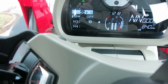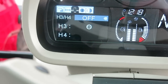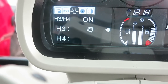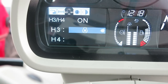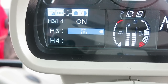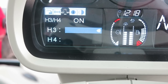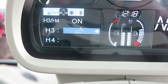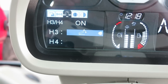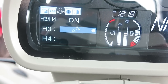You can do it from the dash — you go across, come to your joystick menu, and switch it on. Then you come down and assign your H3 or H4. You've got your cruise, automatic gate, diff lock, four wheel drive — you can turn it off if you don't want it. Your lift, linkage up and down. So where that would come in is if you're plowing — you can drop your plow and then free up your H4 for something else like your automatic gate button.